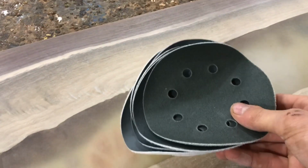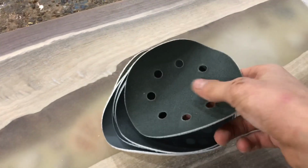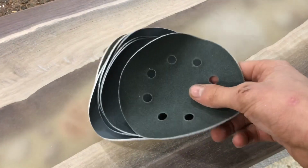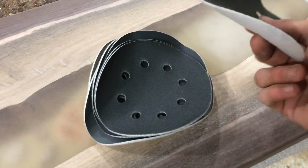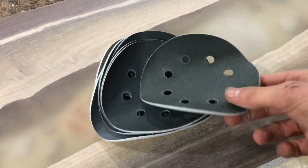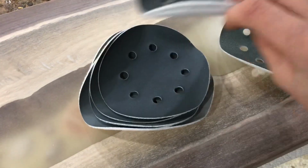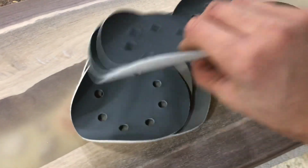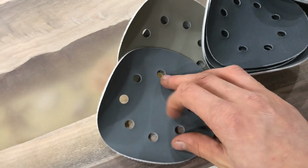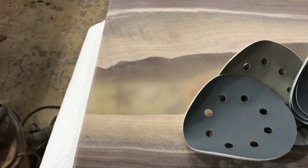They are not on the same grit scale as regular sandpaper, which makes it kind of weird. But just feeling the roughest grit, it's really, really fine. I would say this is at least a 2,000 grit piece of sandpaper. I forget what this is on the MicroMesh scale, but like I said, 2,000 grit roughly on the real sandpaper scale, and then it just goes all the way up until you get to ones like this that have no grit. You can't even feel it. So I have some pretty high hopes for this stuff, and I really hope it makes this board look really nice and clear.